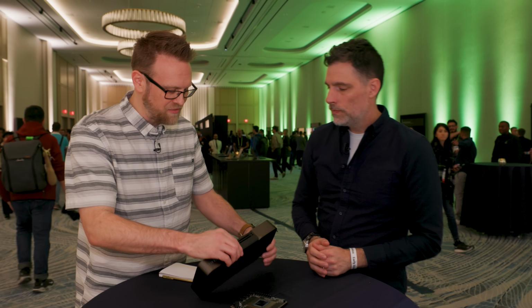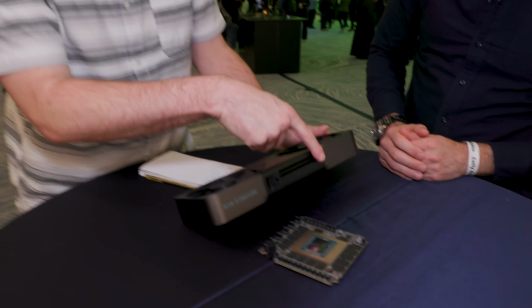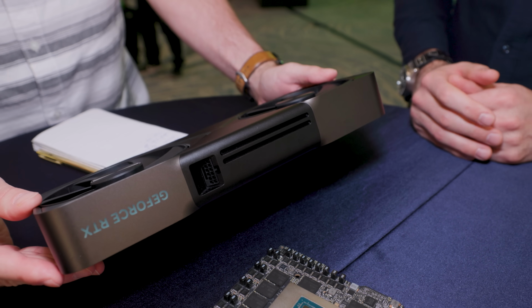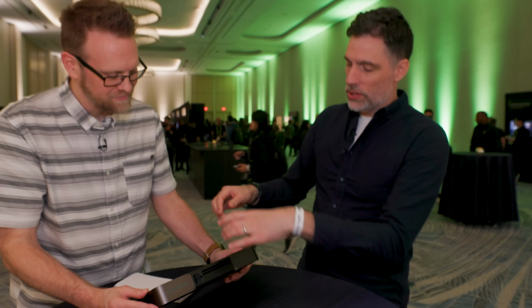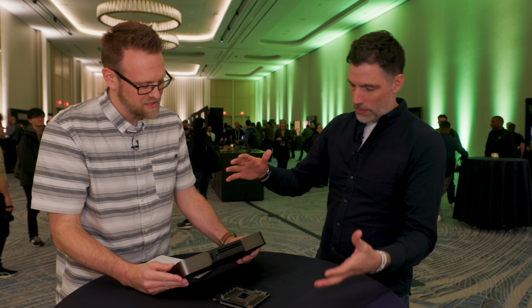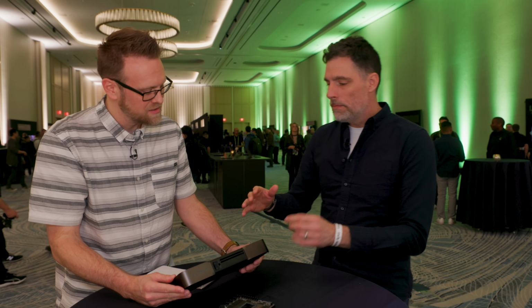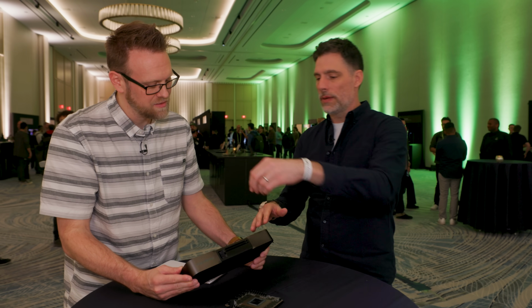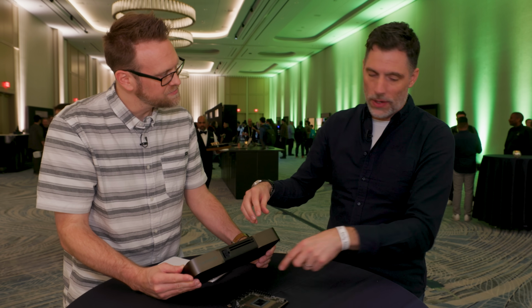Okay, and speaking of airflow, I've noticed these slits on the sides. I've heard there's a significance for the slits. Please tell me why they're there. Yeah, absolutely. So if you imagine all the air is flowing straight through, but it's still inside your chassis. Now there's an exhaust. Most chassis will have an exhaust, and they'll take it out of the chassis. But some of the air, if you're not careful, can go from the exhaust and circulate back around into the inlet, which you don't want. You want the cool air here, and you want the hot air out.